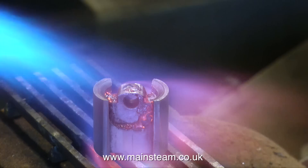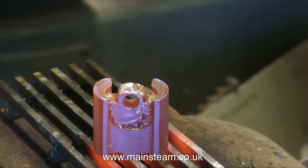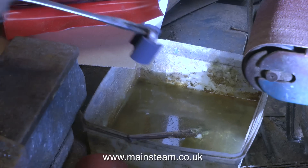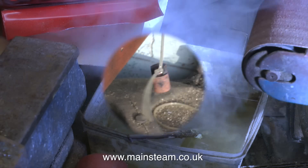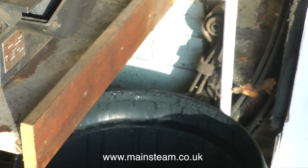For this repair I'm adding far more silver solder than is necessary. Not only will the silver solder flow into the joint, it will reinforce the bearing. Once I turn off the gas blow lamp you can see that the piece of metal is glowing red, so I won't be doing anything much with this until it's turned to black. Never quench a piece of work when it's bright red — always wait till it turns black. This will remove some of the oxidisation but not all of it.